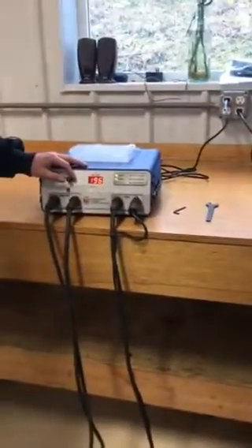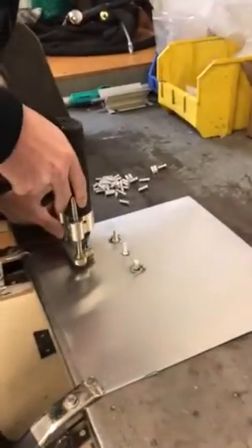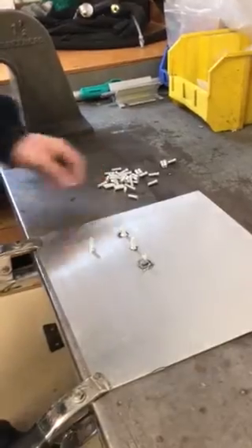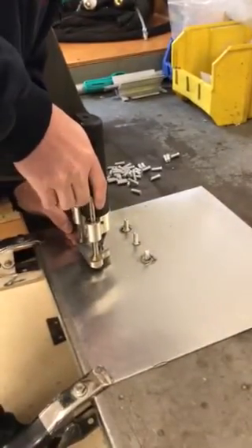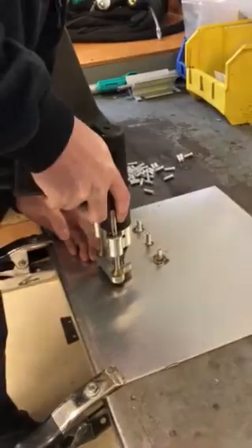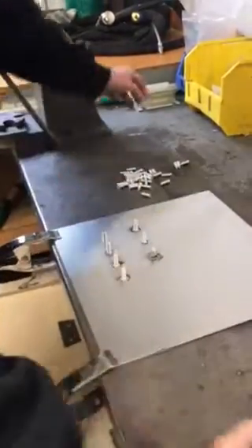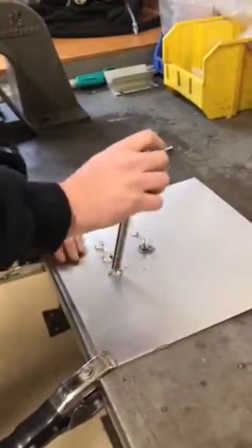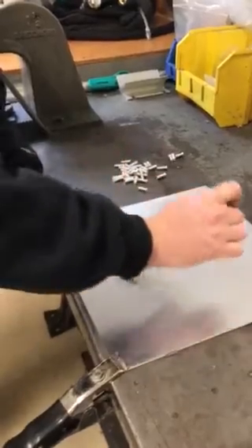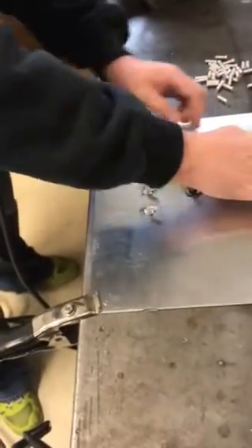So we're going to go back to 150 volts and make a couple of good welds and test them. Once again we have a nice flash all the way around. I like to test them using a bending bar. And there you have it — setup for welding quarter-20 aluminum with a gap gun and a Lynx modular system.